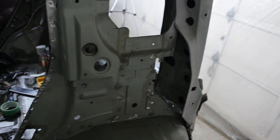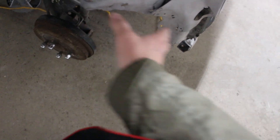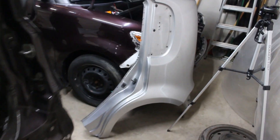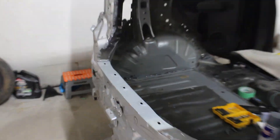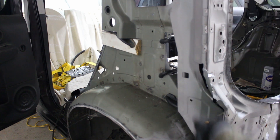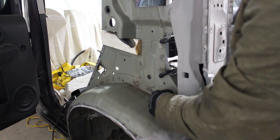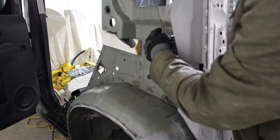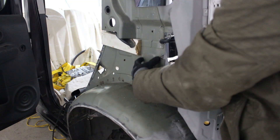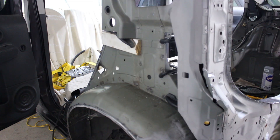Put the quarter panel back on, just offer it up again, just before I weld this piece. Because once I've welded that, there will be no movement — it will all be locked into place. I didn't end up welding the rear floor pan to the new inner wheel arch, deciding it was best to have the movement available while I installed the rear quarter panel. So, all lined up, got the clamps in place, a few self-drill screws, and I've done a few little tack welds. I've just got to do some spot welds up the strut or shock absorber support which runs up to here — just a few little spot welds all the way through to hold that firmly in place. Let's do it!